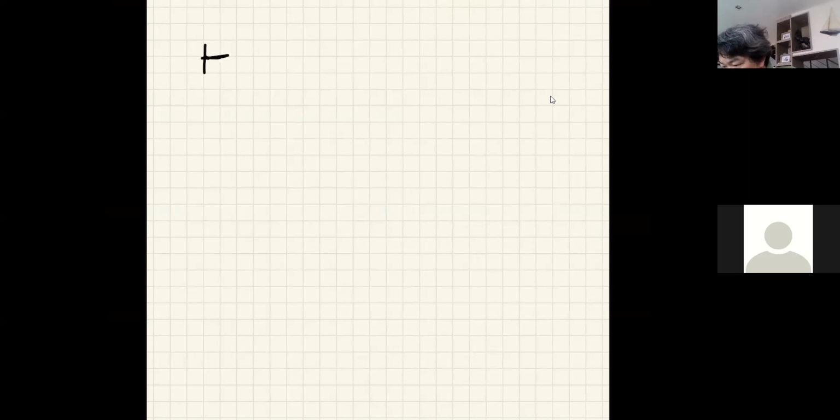So, sorry, just move a little bit. So this is the joint and it's column A on top, column E, and then your beam number 2, okay? So that means for this, we have the counterclockwise moment of 20/3 from the top, so we better have 20/3 here, correct? And then we have another counterclockwise moment, 30 tonmeter from column E, so we are going to have another clockwise moment here as well.